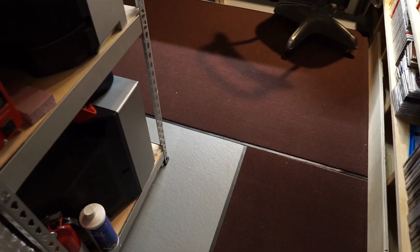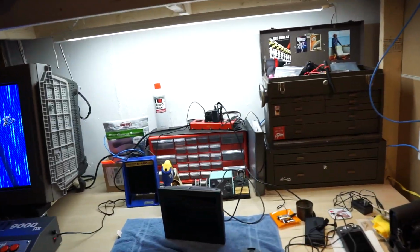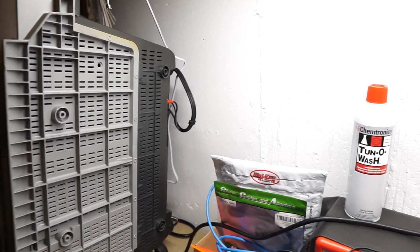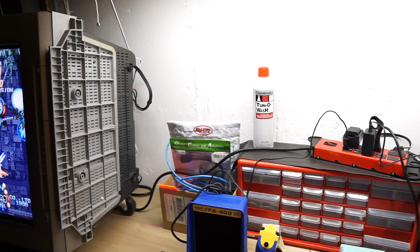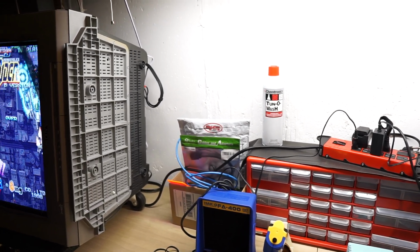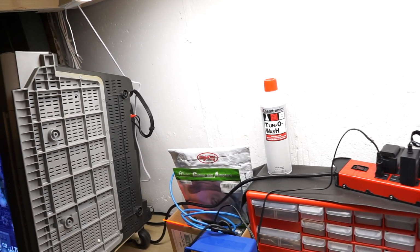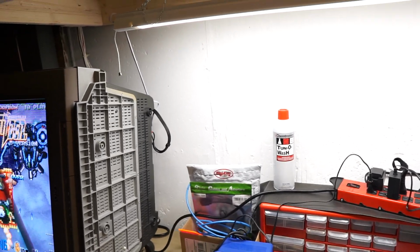So I painted this whole room with this special kind of concrete paint. If you just use regular paint on concrete in your basement, this was always a dry room, so I'm not worried about that, but sometimes paint can react weird if you put it on a concrete wall, since concrete itself is kind of porous. Anyways, this claims to still be breathable for the concrete, so you won't get this weird efflorescence fuzz that sometimes develops on painted concrete walls in basements.